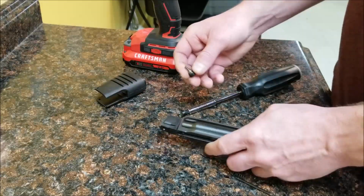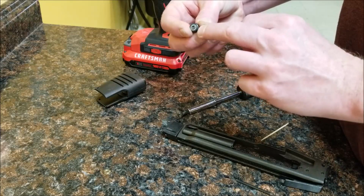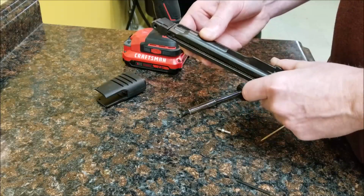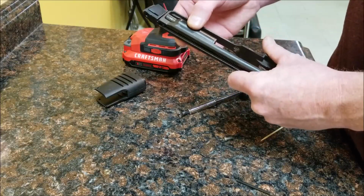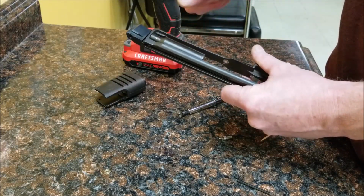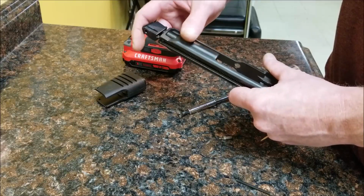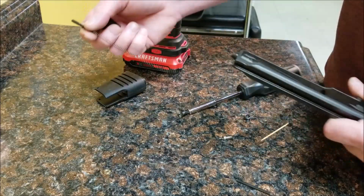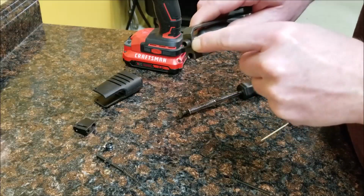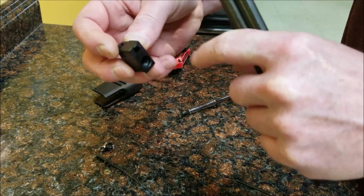All right, anyway, so we can have a failure with our front valve seal and our valve seat seal, and then this O-ring around here. Now, this expansion chamber usually comes off by putting needle nose vice grips on the neck of it and just cracking it open. Fortunately, this one is already loose. And then you have another O-ring right here, and that just slides up onto that flat surface.